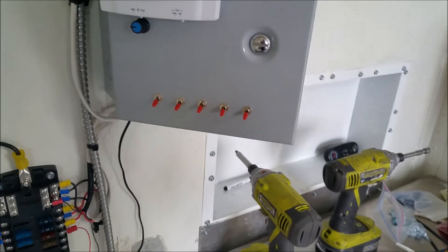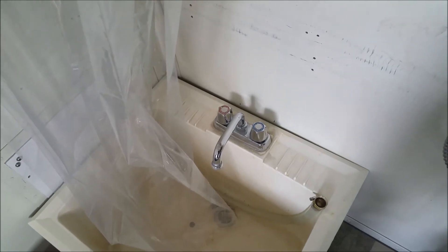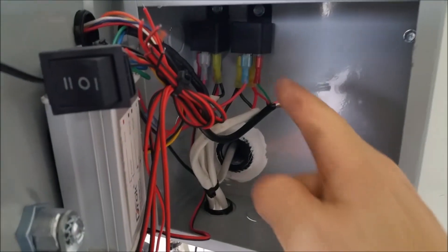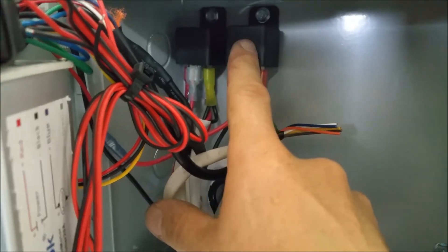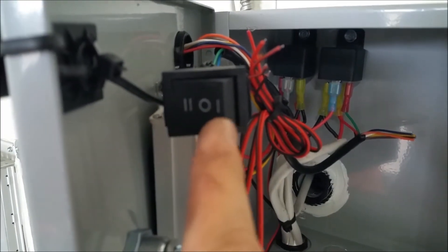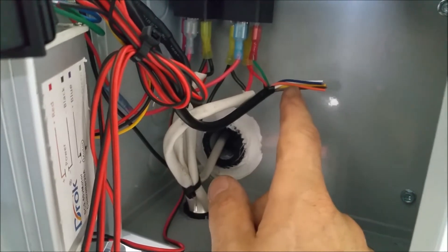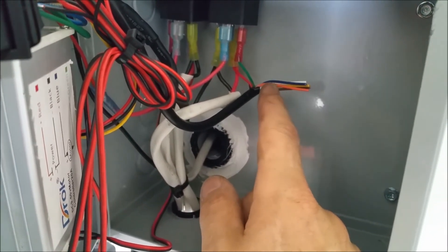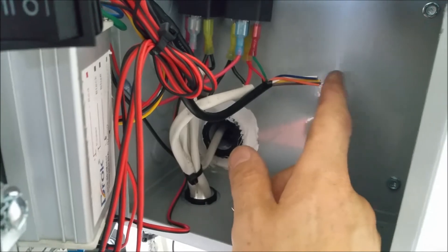I've got all these extra switches — this one right here is on the pump. See — no water pressure, and now water pressure. That works pretty good! I'm going to put a bunch of relays across the back here. I've already got a couple up — this one is for the pump, this one's for the fans, and this one is to change the fan's direction. Right now it's exhausting, so it's pushing out. Remember the 18-7 thermostat wire I told you about in the last episode? That's what this is for — so now I can wire up a bunch of different things to these relays inside this little $15 thermostat.